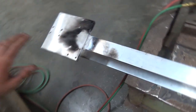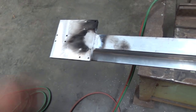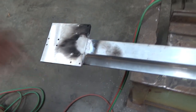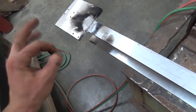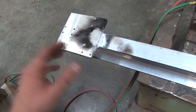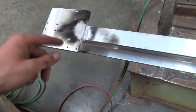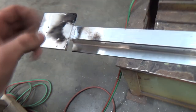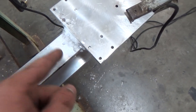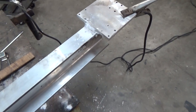So to recap, carbonizing flame over top of what you want to weld. Get all that soot on there, go to a normalized flame, and then wait till all the carbon burns off, because that's around 400 degrees, and that's kind of a good preheat temperature. Get your aluminum there before you even try to use this rod, and it was just gummy, no penetration, until I did this. I think this last one I overdid, and it's undercut, but we'll see when the slag gets chipped off. Would not recommend.